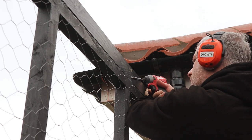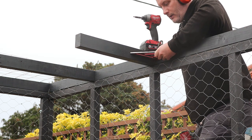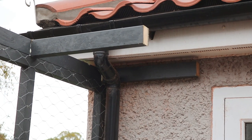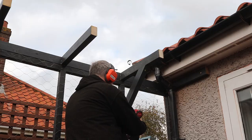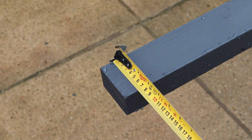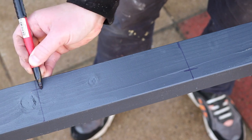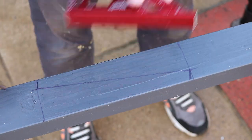A bit of glue and a couple of screws driven in at an angle fix the splice in place securely. Then I add my noggins, again aligned with the wall uprights and again 550mm in length. The last noggin I manage to squeeze in between the downpipe and the wall, which also gives me a fixing point to the wall, so I drill a pilot hole and add a concrete screw. Then I cut and install more corner braces, same as before. Now for the long beam I'm going to give that scarf joint a try. My timber measures 70mm in width; multiply that by 3 and that's 210mm, which will be the length of my joint. I make a mark about 20mm in from the edges, join them with a diagonal, and mark up 90 degrees at the ends - though I realise shortly that's a mistake.